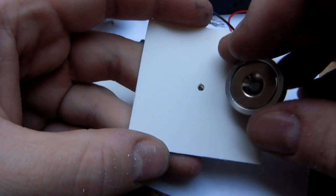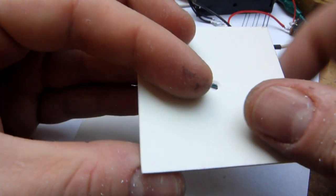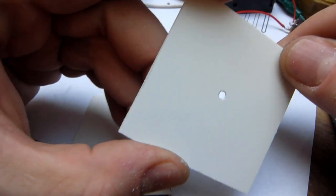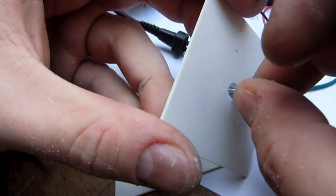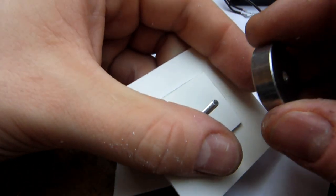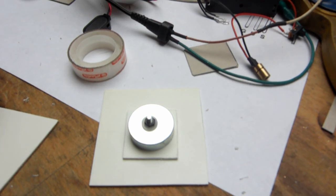So at the bottom, to hold it, I use one of those strong magnets, and to make sure that you can get the screw through the plastic, I'll just reinforce it with another tiny piece of plastic here. Drill it out, put a bigger hole in it, cone shape, and get the screw in. And there it is. And it's gone. Magnet. Nut on top, and now we have our bottom.